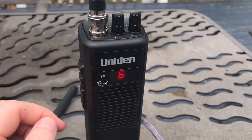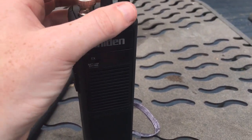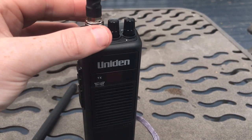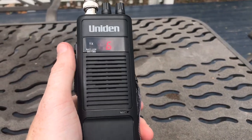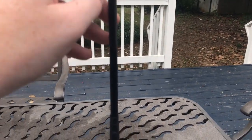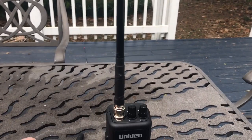It's also important to remember that you are the ground plane. When you hold a handheld CB radio, your body becomes the second half of the ground plane. So if you noticed, I put my finger — no ground plane, ground plane. No ground plane, ground plane. Holding the radio also makes you into a ground plane. It's a pretty serious antenna. Collapsed down, it's about the same size as a stock rubber duck, maybe an inch longer.